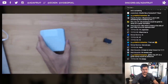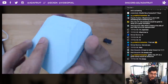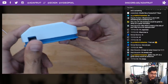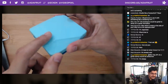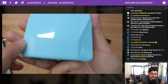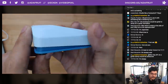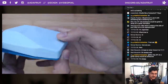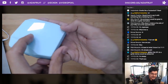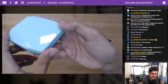Another thing that is kind of required is support material. These sides over here actually don't require support material. The only thing that does require support material is this little feature over here, which you probably can't really see that well because my camera isn't focusing. So this is at some crazy angle. And then this whole shiny piece here is actually what gets laid flat on the 3D printer bed. That's why it's all glossy. It was printed on a glass bed.